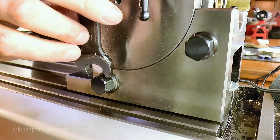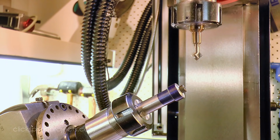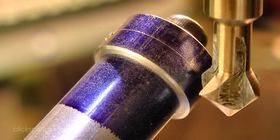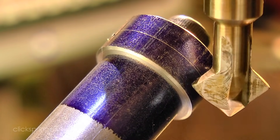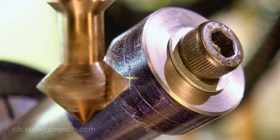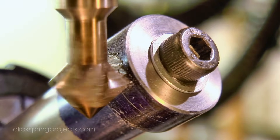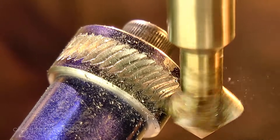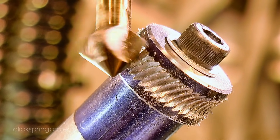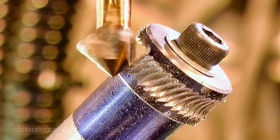Back onto the mill, the work was again secured in the dividing head and then tilted to an angle of 30 degrees. The cutter was carefully positioned against the work to make sure it was centred on the blank, and then the teeth were cut into the knurl. For this particular knurl I indexed for 40 teeth, which was simply one turn of the hand wheel on the dividing head for each cut. The quality of the cut was a little rougher than I'd have liked, so I gave it another pass without changing the depth, and that seemed to clean it up.